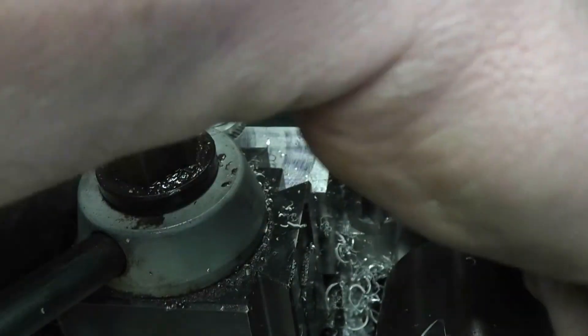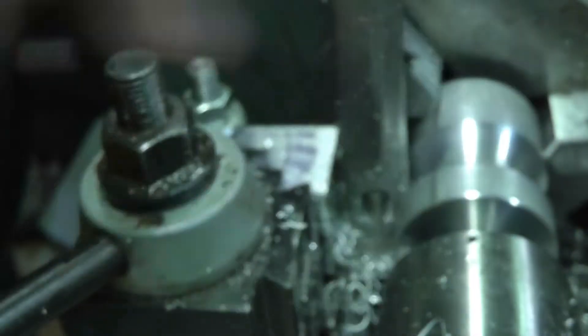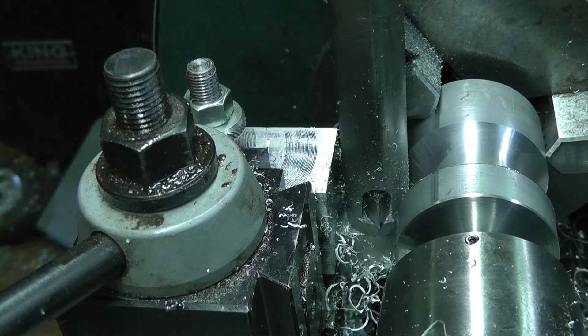Okay, so I was trying something there — I just brought the tool back and forth without changing the distance, just to see how nice a finish it can get. You can see I'm putting my fingerprints all over it, but I'll clean that up. It actually looks almost polished — quite nice. But I had a problem with the compound. I think the compound was getting pushed and moving, because I'm noticing I'm no longer centered on where I want it to be in the die. It's only off by maybe 25 thou, but it's enough that I can see it.